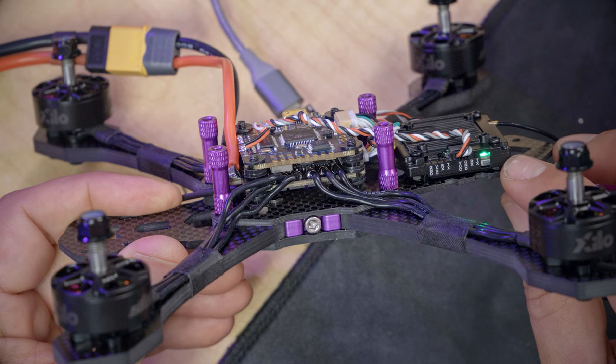Great, but there's another problem we're gonna solve. Watch. If I move this all the way down to the lower right-hand corner of the screen, can you guess whether it's gonna be in the lower right-hand corner of our goggles? Oh, you win $1 million. It's not. Here's how we fix that. What we're gonna do is, first of all, hit save, just to save our OSD layout. We'll come back to this.